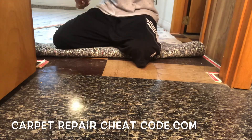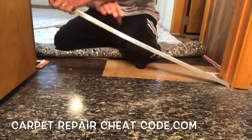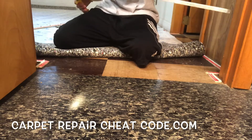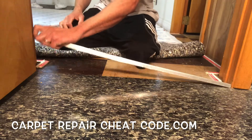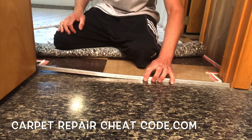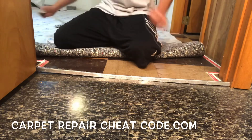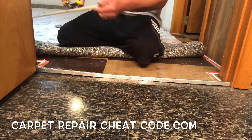We've got the carpet gripper metal here. We don't believe in tape measures in my world, so we're just going to line it up to the door jams and snip away at that with our tin snips until it's nice and even from jam to jam and we're ready to rock. Once it's cut from side to side, make sure it's lined up from jam to jam in the same exact spot.